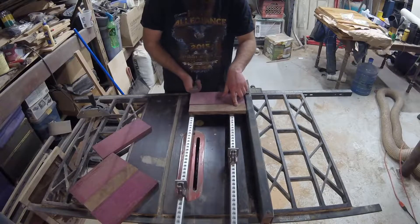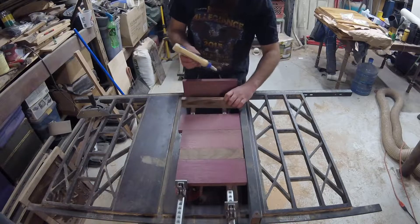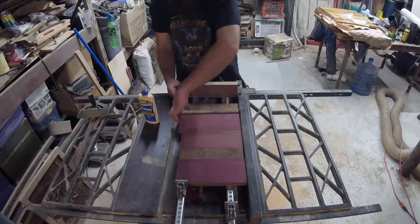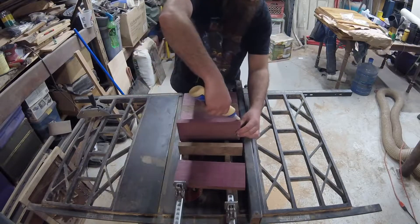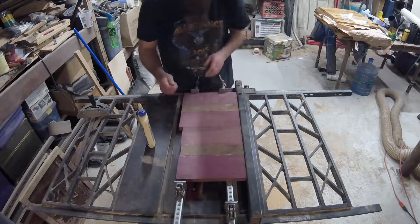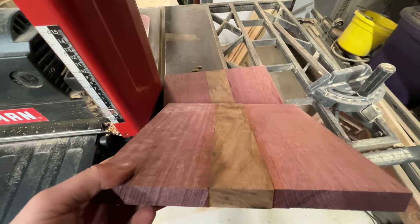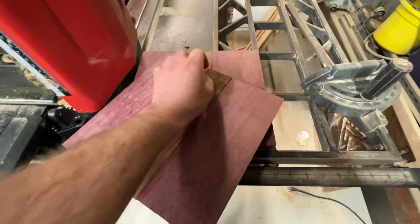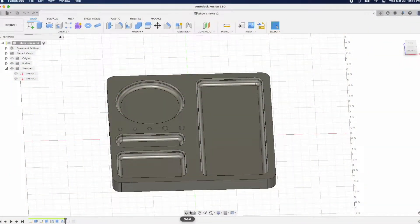Time for the glue-up. Our boards have dried. I'm going to throw them through the planer a few times just to flatten them out a little bit and make them even — try not to get too much snipe. I changed my mind with one of these; it's going to become a rolling tray.